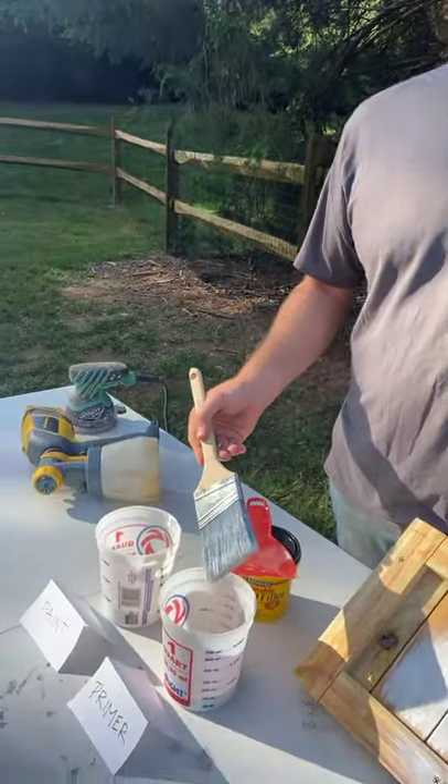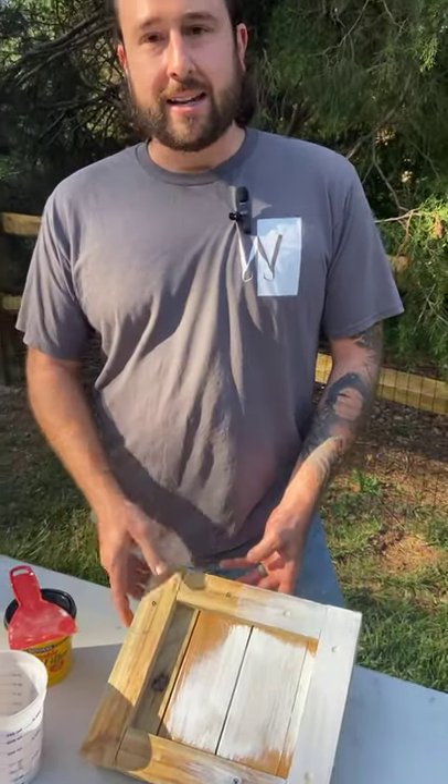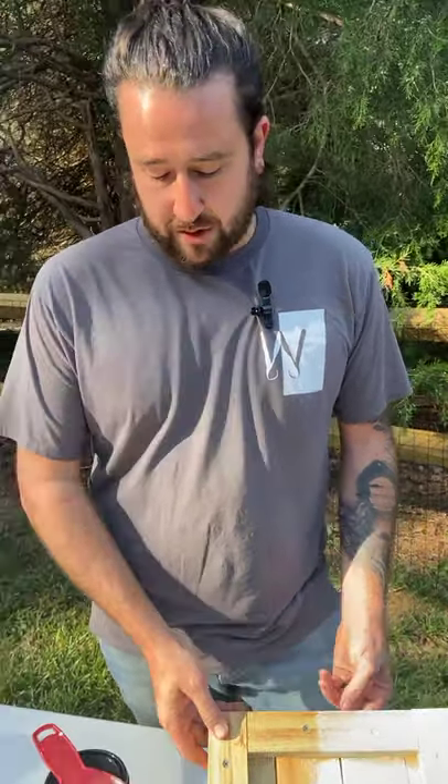Secondly, you have your finished paint here. This is a Promar paint, which you can get at Sherwin-Williams. Again, just express to them what you're doing with it and they'll lead you in the right direction. This is an exterior latex paint, which will last a little bit longer, especially for an exterior application. An oil-based paint will kind of seal in everything and keep the finish really nice, but it's a little bit messier and harder to clean. A lot of people nowadays prefer the latex paint just for that reason, and also because exterior latex paint has grown to give you the finish that oil-based used to.